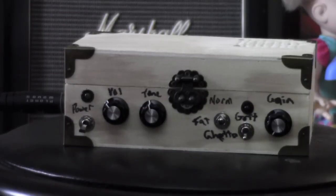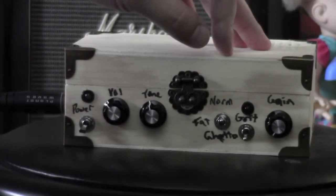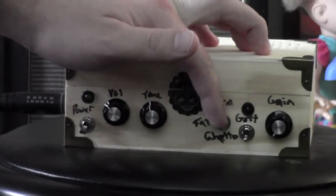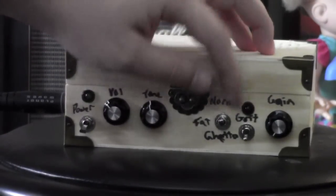This is a bass selection switch. There's a link in the description to the plans, and in the notes someone suggested an improved bass mod which changes one of the capacitors to 100NF. In the last noisy cricket I demoed there's also a full bass mod which changes the same capacitor to 1UF. I've added a switch so I can have all three in one amp. Up is normal, middle is the improved bass mod, and bottom is the full bass mod.